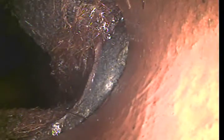Excuse me, we were actually in the sewer. We're actually coming into the main line here at 104 feet. We have a little bit of a root intrusion there at the hub and a pretty decent sized separation there. Probably about an inch. It is at the bottom of the pipe, so it is something that can tie up solids as they go out to the sewer.